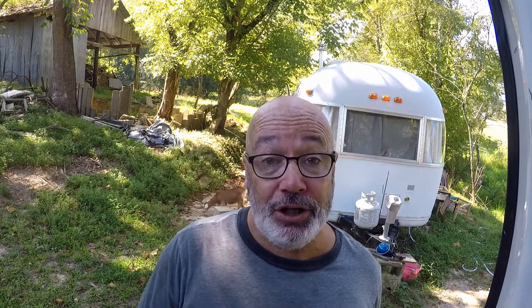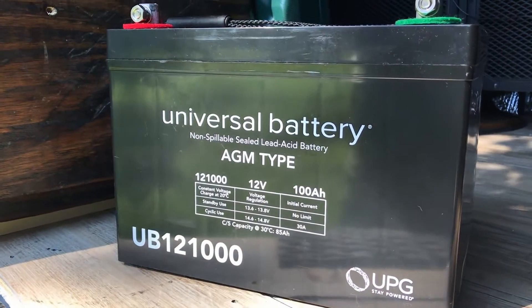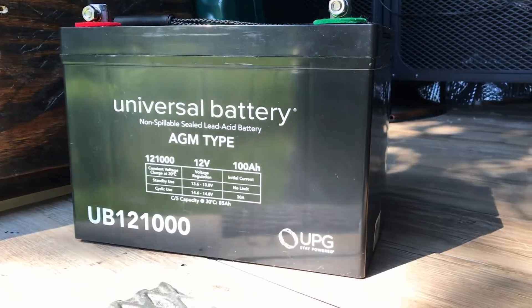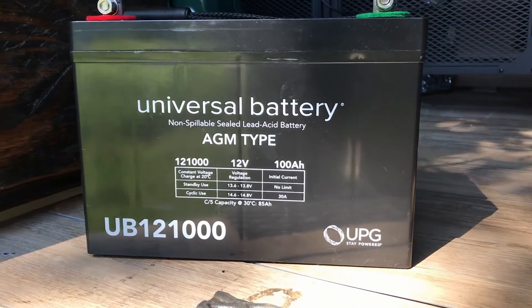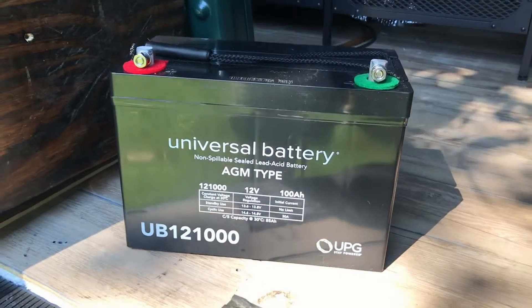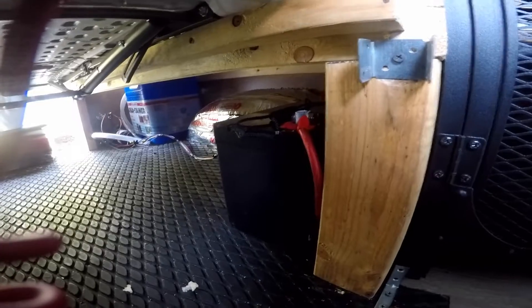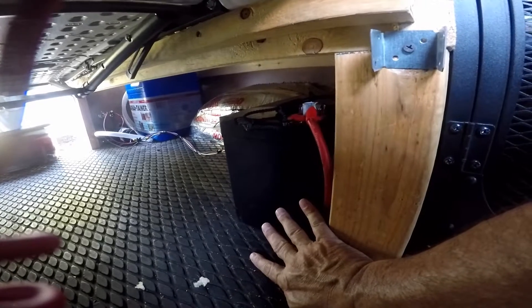Let's talk power. I have 200 watts of solar panels on top of the van. I'm going to hook that up into a 30 amp solar charge controller and a 100 amp hour AGM battery. I bought this battery — it's about $193 for one 12 volt 100 amp battery, which is more than enough for our van. It also acts as a backup, so if you add those two together we'll have over 500 amp hours of battery life between the van and the Airstream, and over 600 watts of solar.